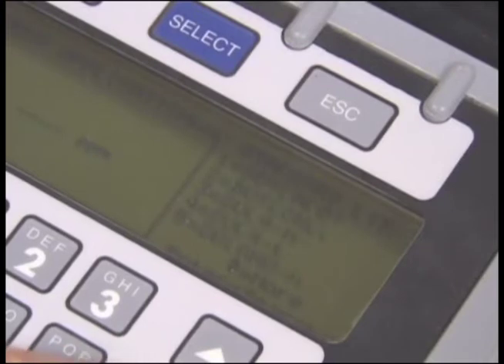Make sure the gas being measured matches the gas selected on the instrument. Select Enter and follow the instructions on the window display of the unit. It will take approximately one minute to collect the sample and display the reading. Repeat as necessary.